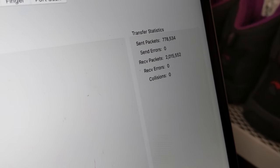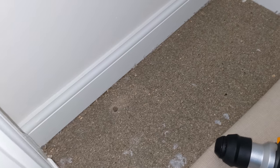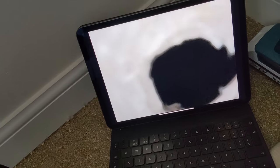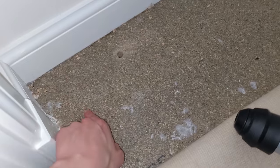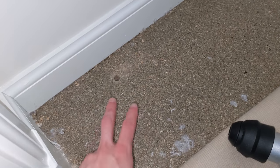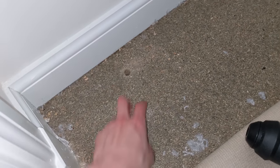What we've done is drilled a small hole above that phone point in the hall, then used a neat little Wi-Fi borescope to look down and see what's there. We've been able to see what looks like the Cat5 cable going down into the wall. There's also a bit of twin-and-earth over here for a socket, but with the borescope it's quite hard to work out which way is up, so we need to be very careful drilling. Now we need to open this floor up.